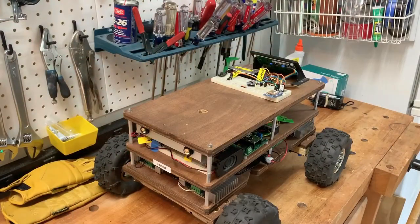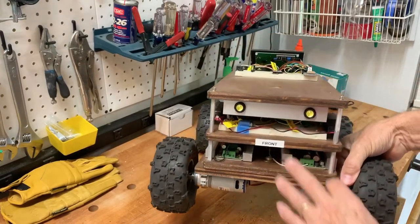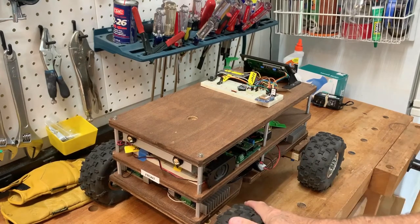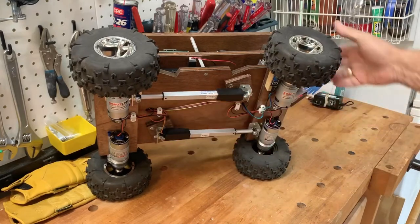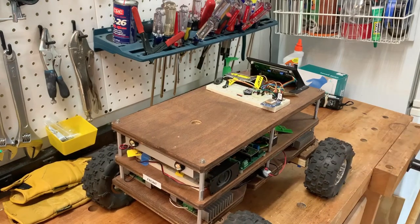The last piece of the critical support infrastructure technology is this unit — a mini-robot, obviously, with all the same components and equipment as the larger chassis scaled down, with just a few differences. The motor controllers up front are the same saber-tooth units, but they're smaller amperage because we've got very little motors, and we're running at 12 volts here, not 24. The actuators underneath, just due to space considerations, are arranged in a side-by-side configuration as opposed to the big robot where they're back-to-back running the length of the chassis. This means the motors driving the actuators need to be programmed a little differently, but we handle that in the software, which has internal code switches to compile whether you're compiling for the larger robot or the small prototype.